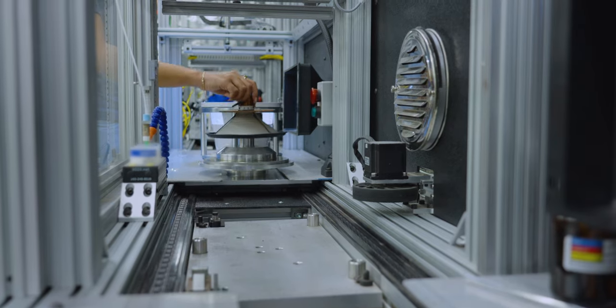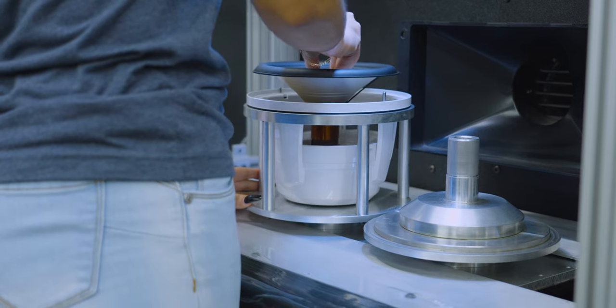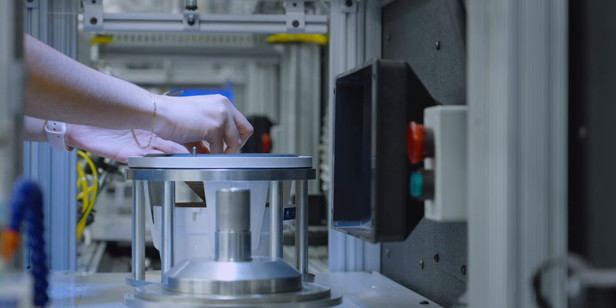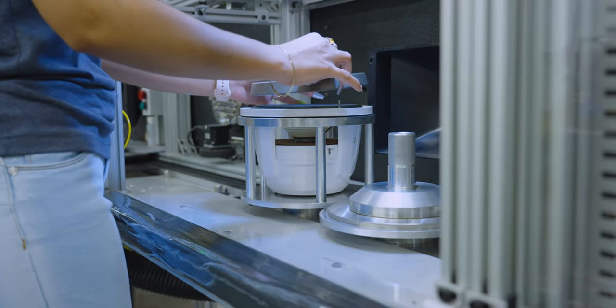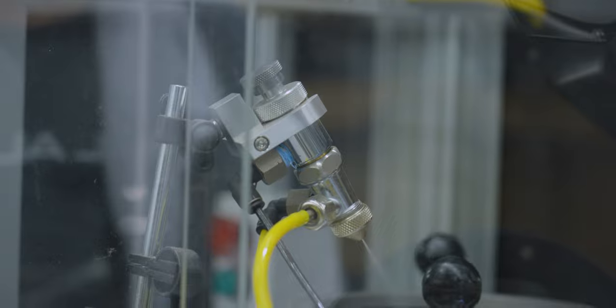The cone assembly, now dressed with a voice coil, spider, and lead wires, is placed down into the basket for final adhesion. Once fitted inside, a weight is placed on top to secure the two parts, and it's sent into another chamber for another application of accelerator. The accelerator makes sure that everything is firmly adhered before the lead wires are routed and final connections are made.